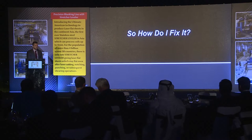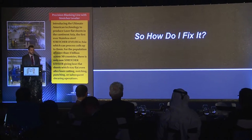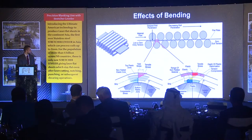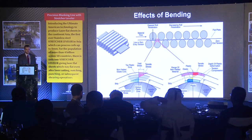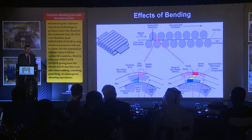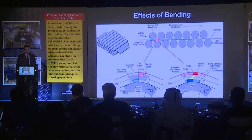How do we fix it? The most common type you'll see around the world is using some sort of roller leveler or passing the material through a series of rolls — it's the easiest way, but not the most effective. One problem with just using a roller leveler is you are restricted to a given gauge range based on the diameter and spacing of the work rolls. Typically you'll plunge the rolls quite deep in the beginning and feather it out towards the end. The main issue is with a roller leveler or any type of rolling leveling system, you will never be able to work the center strand of the material — so you can never guarantee that the sheet will be stress-free.